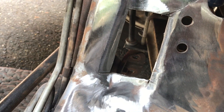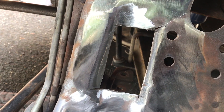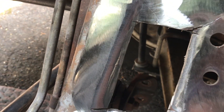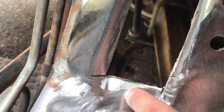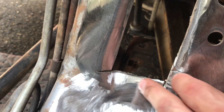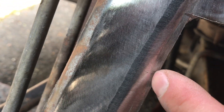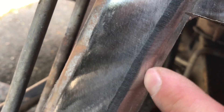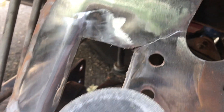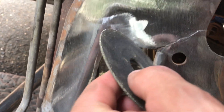I cut out all the bad sections. It already starts to look a whole lot better when you cut the cancer out. I was able to clean up down here more now that I can dip the flap disc in farther, and there aren't any more cracks — only in the areas I previously identified. I'm still suspicious of one spot. The next step is to take my cut wheel and actually dig a trench in each crack.